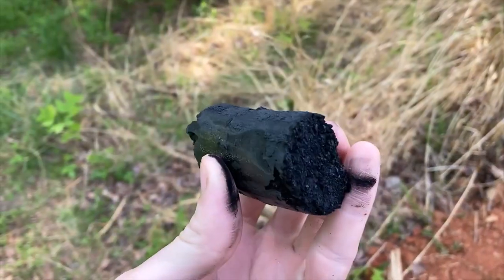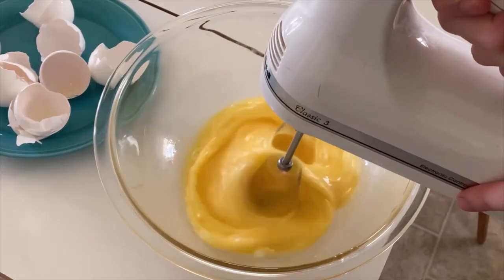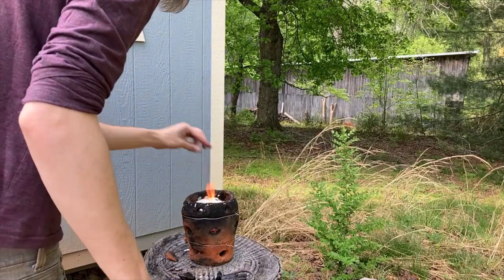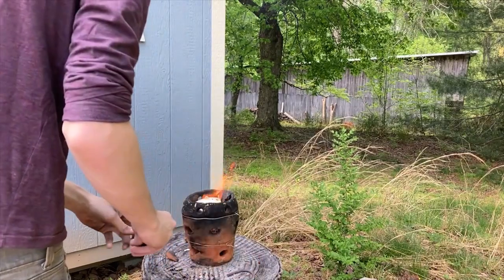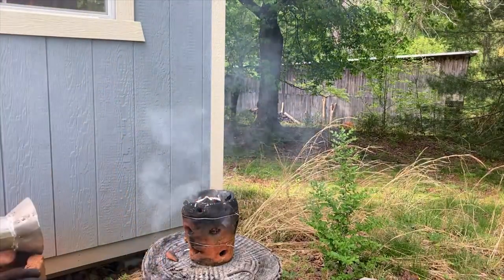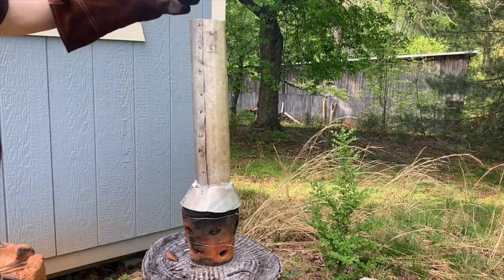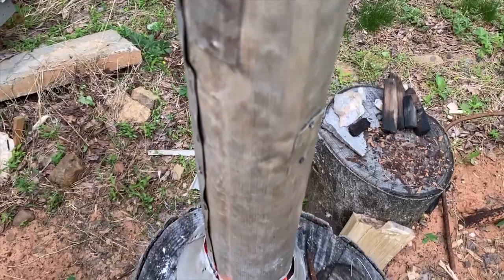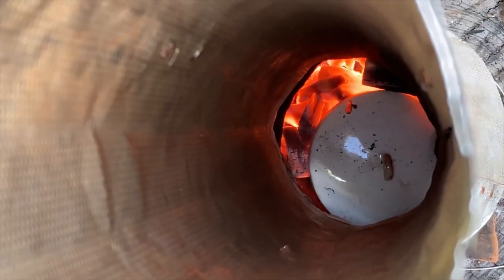With the batch complete, I can finally start up the furnace. However, without anything to heat in the furnace, it would be a waste of time and energy. To test the furnace, I made myself a quick sponge cake and had brunch with the family. Sponge cakes use an obscene amount of eggs, and eggshells are primarily calcium carbonate. So I saved off the eggshells in order to calcify them, or thermally decompose the calcium carbonate into the much more dangerous and exciting calcium oxide. Faraday specifies to light the furnace with a little brown paper, so I threw in a crumpled sheet and a few broken wood splints along with smaller chunks of charcoal. The strong draft from the chimney makes the act of lighting the furnace easy and fast, and for a brief period summons a column of flame through the length of the chimney. Once the paper and wood burns away and the coals are lit, the furnace rapidly increases in temperature to a blistering white heat until the chimney is removed.